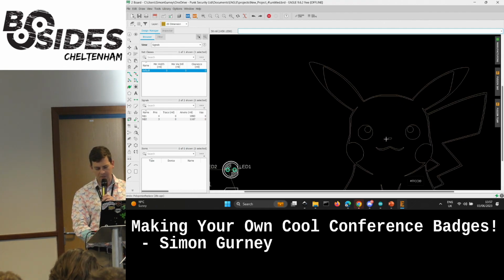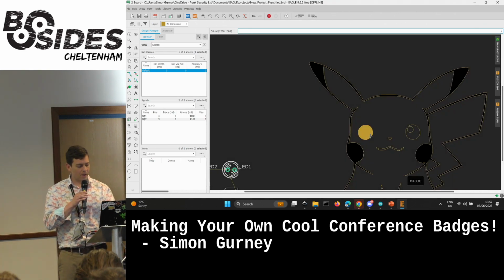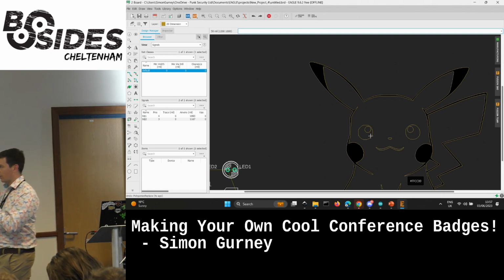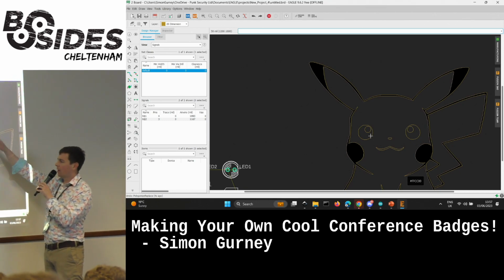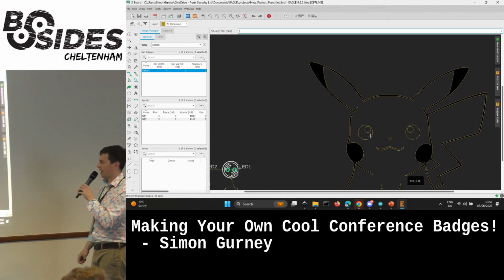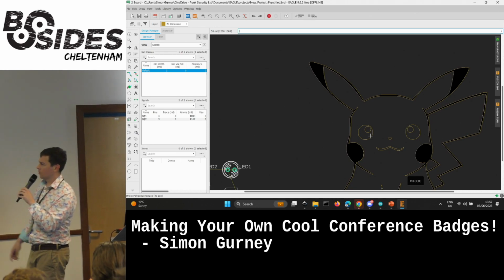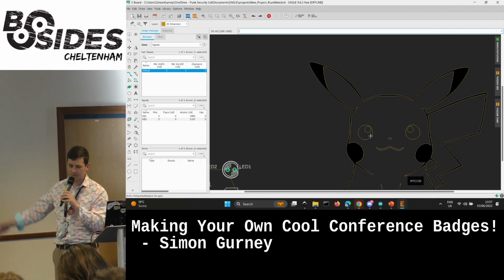If we do the individual shapes inside, like this one, we can turn that into a shape. So to go back, when we do the solder mask fill, say we wanted his eyes here to be white, then we need to create a white circle. We can't just have lines. So if we want to use this as the outline for Pikachu, it needs to be a shape so it knows to do the fill. So what we want is just that outline, but we can't get it because it's got cutouts in it.